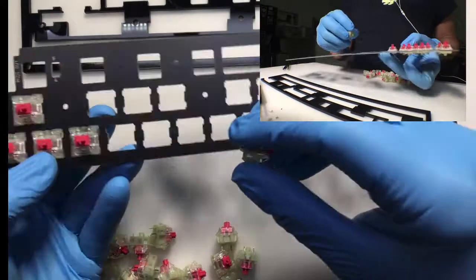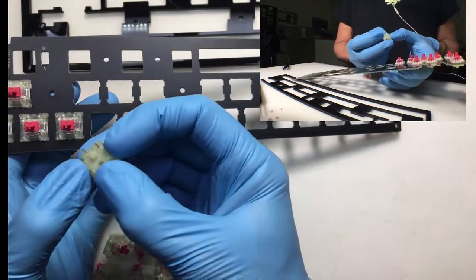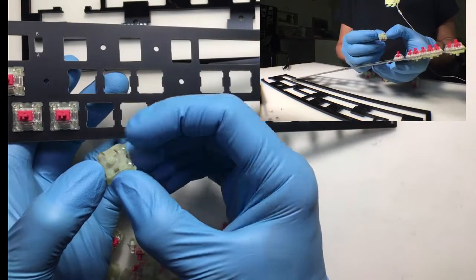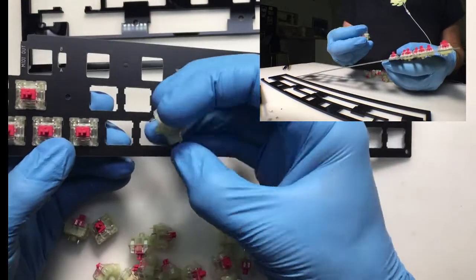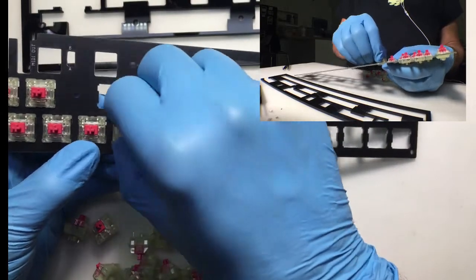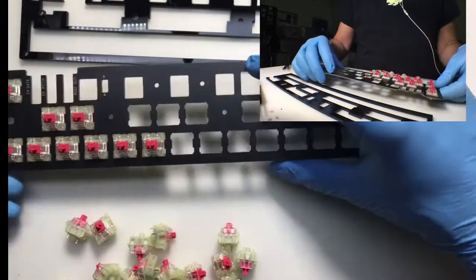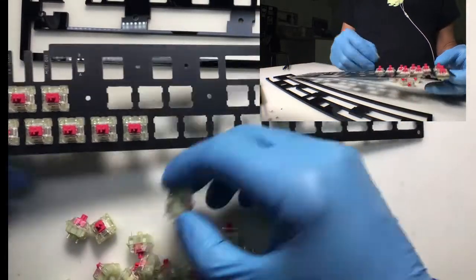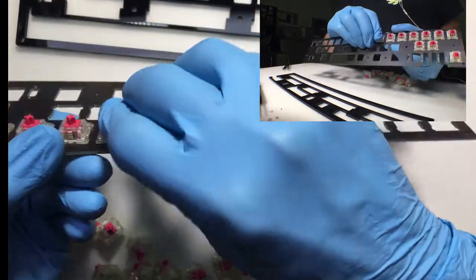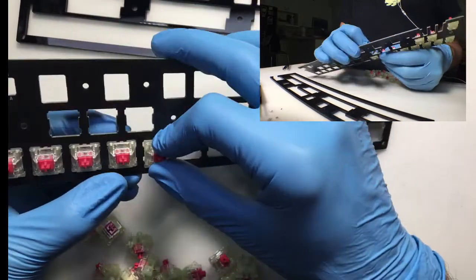The whole idea with this keyplate thing is that these switches do not have mounting supports on the side. So on the PCB, you'll see some extra holes to the side, and that's for a different kind of switch that has a snap-in sort of connector thingy on the bottom of the switch. These switches do not, and they rely on a keyplate to help support them and keep them from wiggling around. Things you learn studying about the keyboard things, the mechanical keyboard world is kind of crazy.